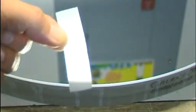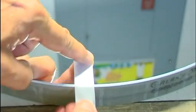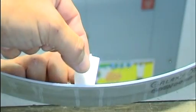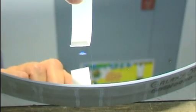Just a simple piece of clear cellophane tape. I'm going to stick it down there and rub it real good, make sure it's stuck on there real well. I've done this many times for the government. They require just a light pull — and if the coating comes off, the film fails; if it stays, the film's okay. A very moderate test. The government doesn't expect much from these mirrors, compared to what I put my coatings through.